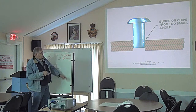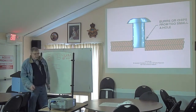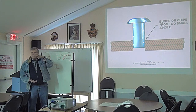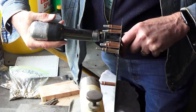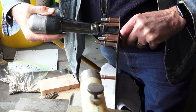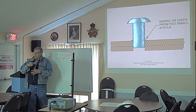If the rivet itself causes a problem, it's going to peel the finish off, and we don't want that to happen. So we need a bit of a gap in that hole. What ends up happening: we drill the hole, the rivet drops into the hole, and when we start to buck that rivet, the rivet gun is driving on the rivet head. The bucking bar is actually what's doing the work — it bounces off the end of the rivet and comes back, and in coming back it flattens the rivet. The reason we oversize that hole a couple of thousandths is so we can drop the rivet in easily. Then the first couple of hits, the rivet expands and actually fills that hole tight.